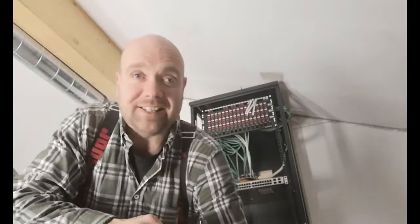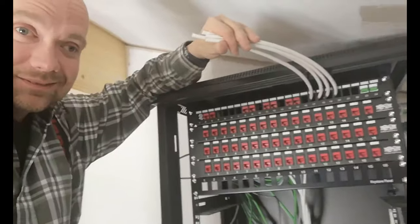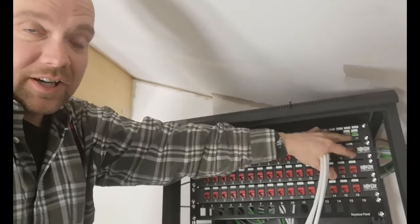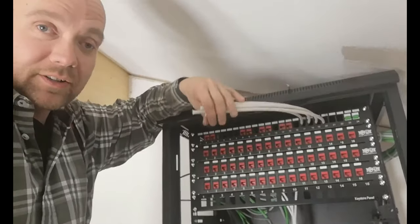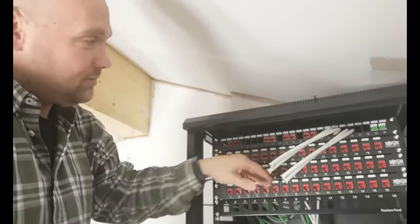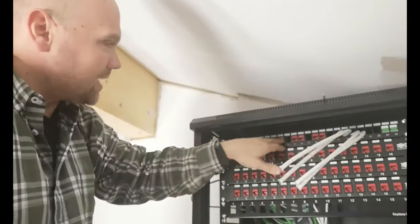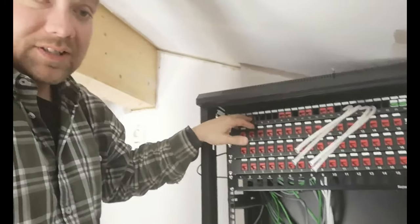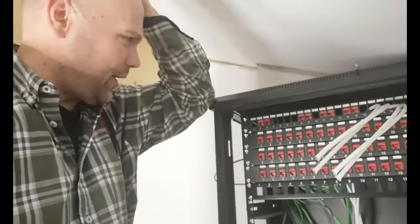And that was the last keystone. There's only like almost 60 of them, but that was the last one. Look at that. So I got fiber coming up from downstairs. We're gonna splice that together down in the electrical panel. And then I got some outdoor drops and a couple down to the same place as the fiber. There are those two. And then those are going outside on the north side. I'm not sure where the other pair for the north side is, but somewhere in here.